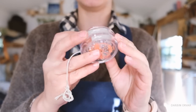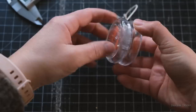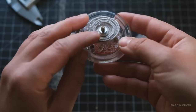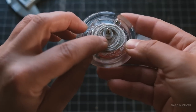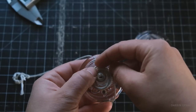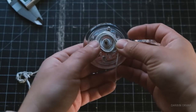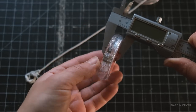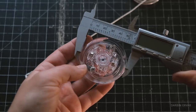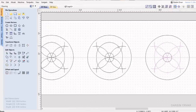To start out with, this is what I have, so let's use this as a guide. Basically, this just comes apart. Screw here, we have a plastic kind of washer and a metal washer, and then the string that goes around. This one also has some screws and batteries because there's LED lights in here, but that's kind of beside the point. This one is exactly half inch thick, 2.2 inches wide. I figured, I have a CNC machine, I'm just going to plug in these numbers and cut out some rounds.